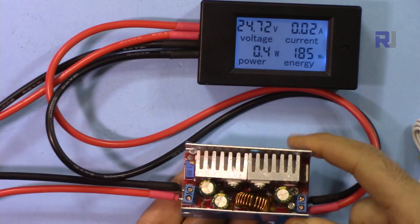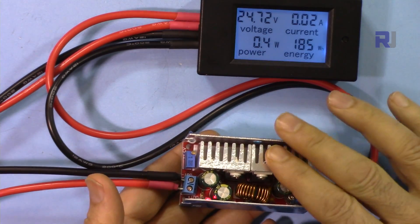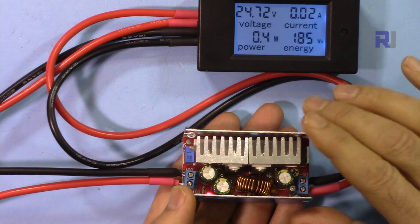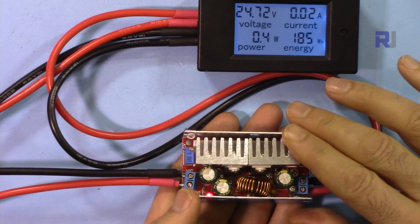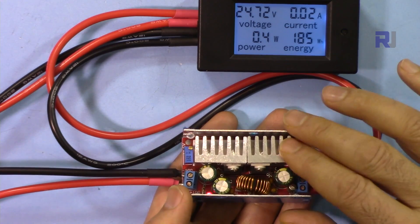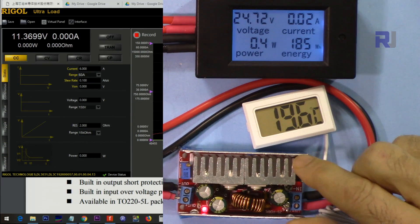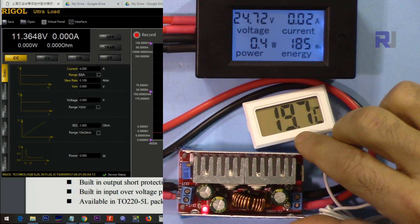In conclusion, this module can accept up to 30 volts of input and output various voltages down to around 3.3 volts. It can be used as a buck converter with any output voltage. With input of 30 volts and lower, the reliable continuous current is 6 ampere. For short periods you can get 7 ampere, but 8 ampere will never be reliably possible with this small heatsink. If you extend the heatsink or add a cooling fan, 8 ampere might become achievable. Thank you for watching this review of the XL4016. If you like this video please give it a thumbs up, leave a comment or question below, and subscribe for future videos.